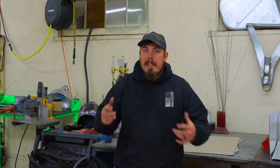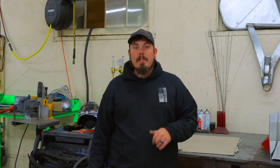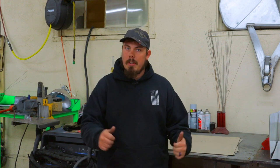Now we're diving into this — let me point out a few things. Making an aluminum tank for your truck or vehicle generally is not too difficult to do. The biggest things are making sure you get the right measurements and the right angle so the gas flows to where your pickup is. If you're welding aluminum, the most challenging part is the welding itself, but over time you get better at it until you just dab away and you're good to go.